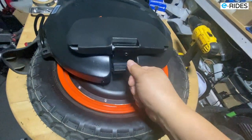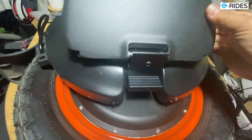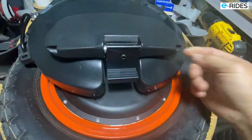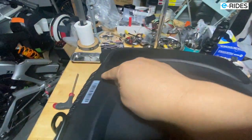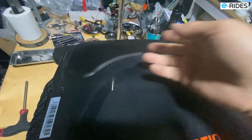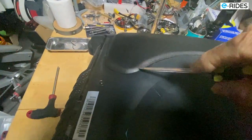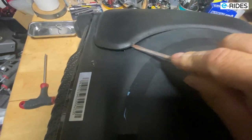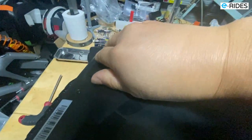Let's get started and open it up. Lay it flat, loosen the nuts there — this is the bolt that holds the pedal rod. Once it's all loosened, tap the rod out and the pedal comes out. Then remove the two screws. Pull the top off by putting a screwdriver in there and it will pop out — there's a clip and off it comes. Pop it in the corner there and push it back, and off it comes.